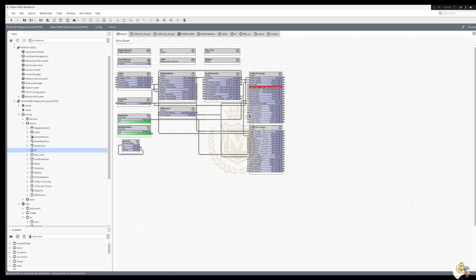Now, with the touchscreen on this particular job, I used the second port on the Mac 36 controller Ethernet port, and I set that to 10.0.0.125. So the touchscreen is actually using port 8002, but the touchscreen that has been done for this job automatically logs you in, and you can't see any of that without actually going in and looking at the password. But even if they knew what the HTTP port was, they still don't know what the other two ports are, which has added security in my view.